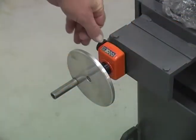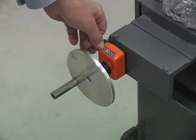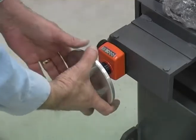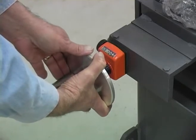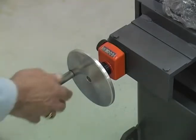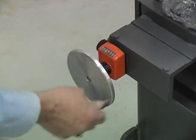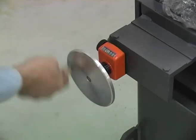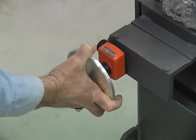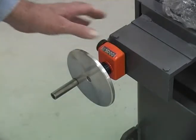The length on the bar feed reflects inches to three digits — this is set for three inches exactly. Three inches and five thousandths would be 3.005, for instance. To change this to five inches, we just turn this knob to five inches, and this locks it in place so that it won't move.